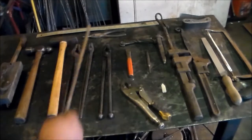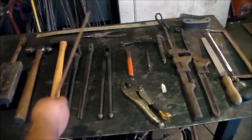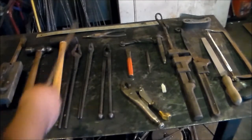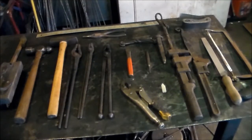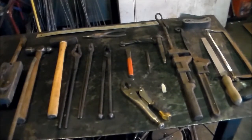This is not a regular set of needle-nose pliers. When I first started blacksmithing, I needed a set of scrolling tongs, which are essentially needle-nose pliers. So I bought a set of needle-nose pliers and forged the ends to be rounded, so they don't have those corners on them. You can do that with a cheap set of needle-nose pliers — keep your eye open at yard sales and flea markets. Once you have your forge going, you can forge the tips around and you'll have a little set of scrolling tongs.